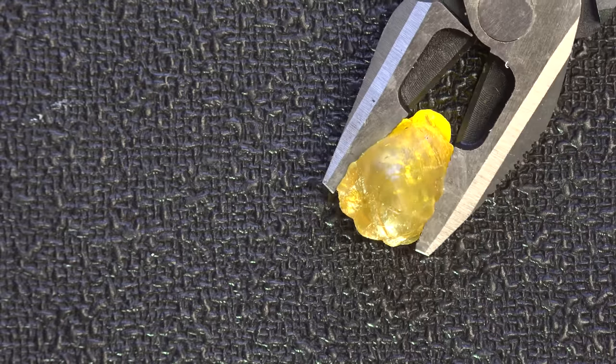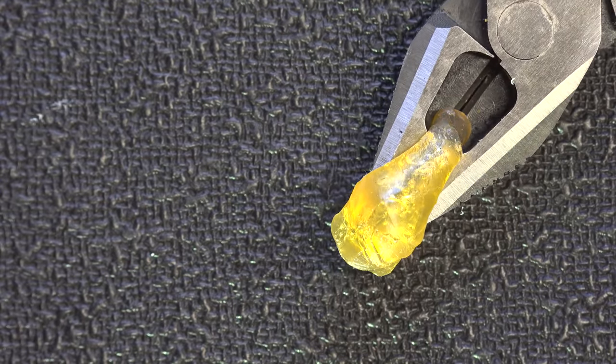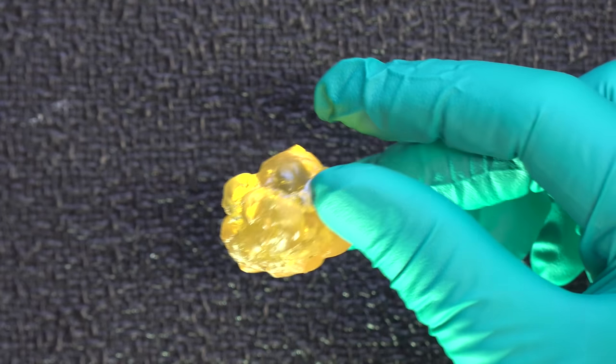You can repair them or change them in the future — these Wago gel boxes pretty much have an indefinite life. Personally I love these things because everybody wanted waterproof connections, but they're not perfect and they're not the cheapest thing in the world, so you're going to reserve these for when you really need them. These gel boxes are actually not new — they've been in Europe for several years, but they were not approved to be used in the US until just this year.